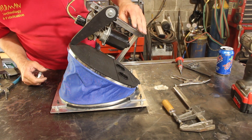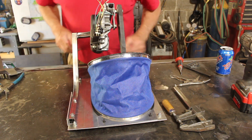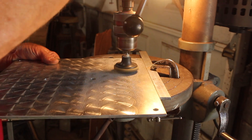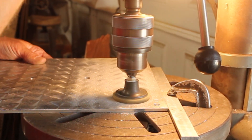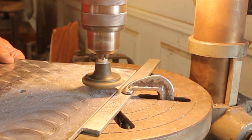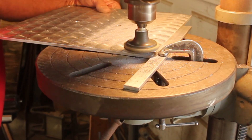That is too wobbly. Even though I put this extra gusset on there, this whole base plate is flexing. The other base plate was just too thin and it was flexing all over the place. I found a piece of 3/16ths aluminum, which is completely rigid, but it needed to be dressed up a little bit. So I decided to scrub this fish scale pattern into it.